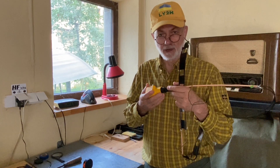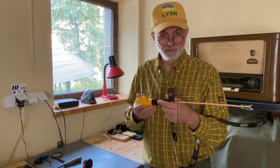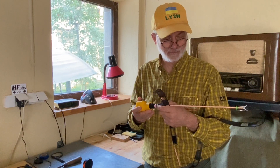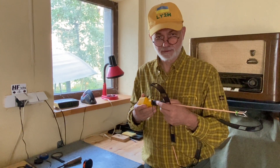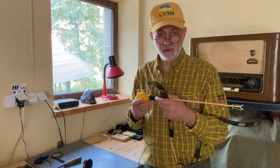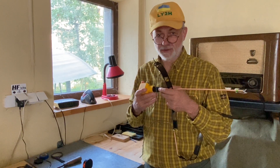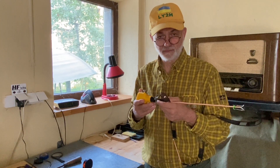To sum up: what kind of antenna is this? I would say it's cheap, reliable, easily homemade, and a good everyday VHF/UHF antenna. It probably won't beat a monster VHF/UHF Diamond antenna that's 7 meters long, but it doesn't take up much space. It certainly works better than a rubber duck or a quarter-wave mono-band antenna, and it could serve for years for everyday purposes: opening repeaters, doing digital VHF/UHF traffic, and ragchewing with local hams on local FM networks.